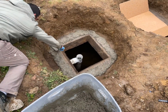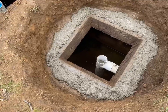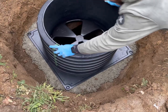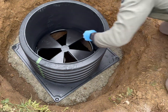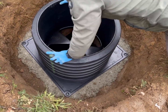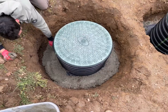After we got some concrete mixed up, we laid a small bead all the way around, anticipating where the corners of the flange would sit. We made sure we got about an inch, maybe two inches of a nice bead so we could place the flange down directly. Once we got it lined up, we just gave it a little pressure, pushed down, checked to make sure the seal was seated right, and gave it a couple more pushes down.